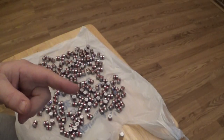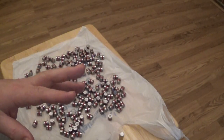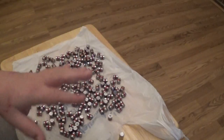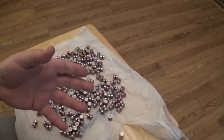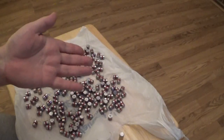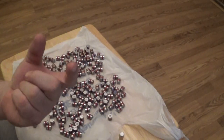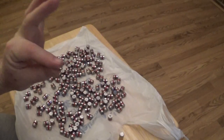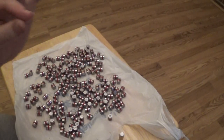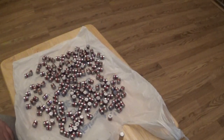Want to give a shout out to Loads of Bacon — awesome channel. Also The Reloader Dude asked me a question I wanted to address. He asked if I use beeswax on the locator pins on my molds. Beeswax is excellent stuff, one of nature's wonders, but it's kind of pricey. What I use is a very small birthday candle — that gives me the pinpoint accuracy I need to get into the pins. I put a little on the sprue plate hinge and lubricate the locator post for the sprue plate stop, and that's pretty much it.